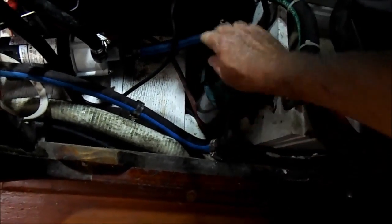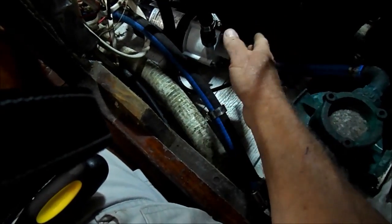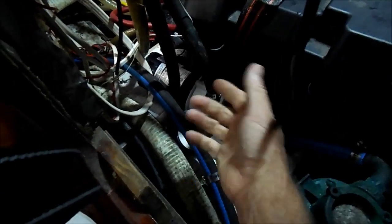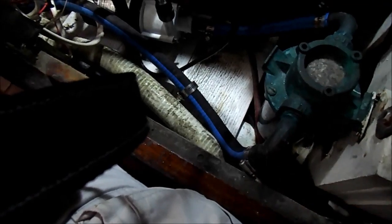What we're going to be doing with our hose today is basically taking off this clamp, putting on a hose fitting, and then blowing it back out to the ocean. Then we'll change it and blow it up out of the unit that way. A note of caution here: you do not want to blow the hose through this unit — don't blow it through your pump because that will damage the system. What we'll be doing is taking off this clamp to force any debris out through the through-hull, then attaching the hose to blow up to the coils beside the air conditioning unit, discharging outside the boat. But don't force water through the pump — that is not a good idea.